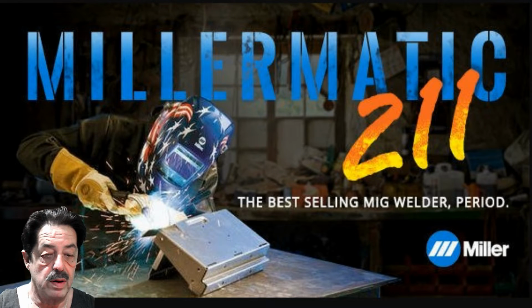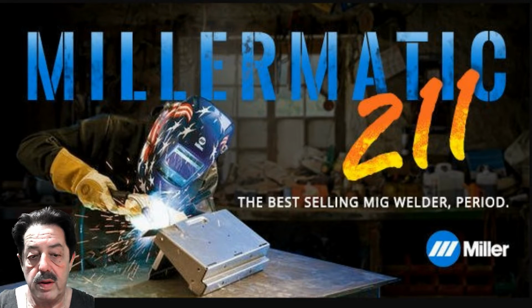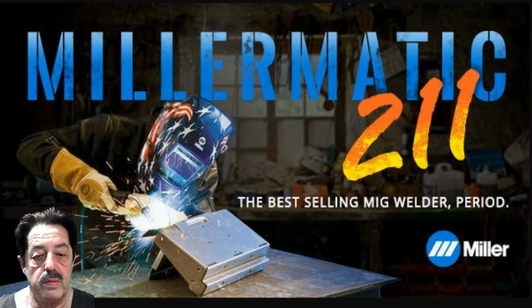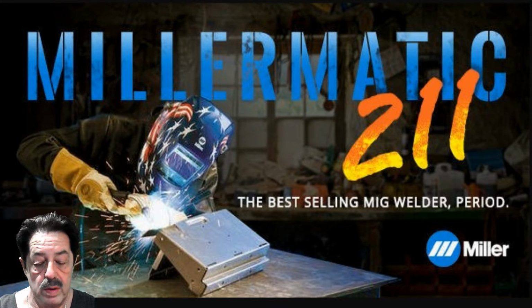Now, before we get started and we get into the shop, there's part of the video that got deleted. And what I wanted to tell you, somebody goes, well, when it comes to abrasive wheels, what do you use? Well, I did a whole video on that. The 2 primary wheels that I'll use are flap wheels, which go from 40 grit, 60, 80, 120, whatever. And I use the 60 and the 80 frequently. I also use cutoff wheels. Now, there's nothing wrong with the ones you get out at Harbor Freight. I just don't think they last all that long. And there's nothing wrong with the cutoff wheels.